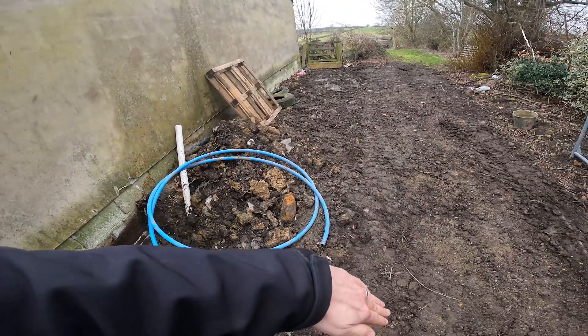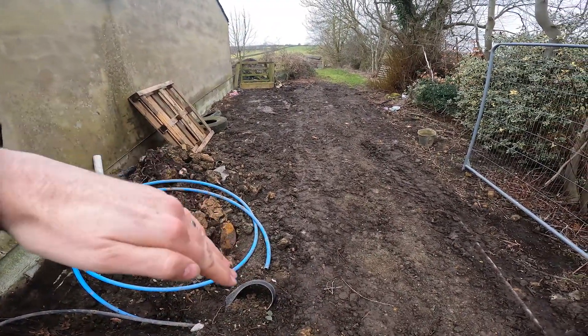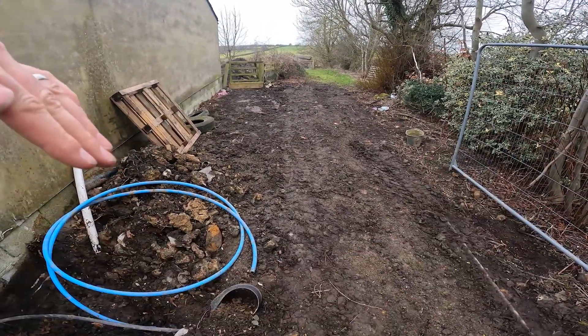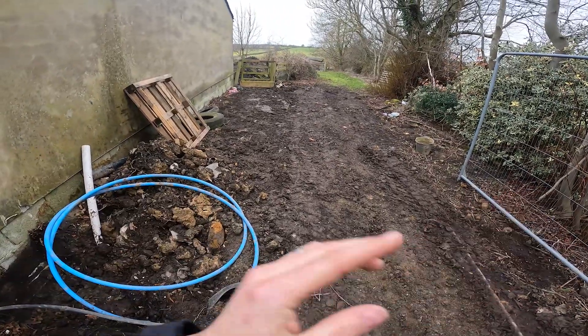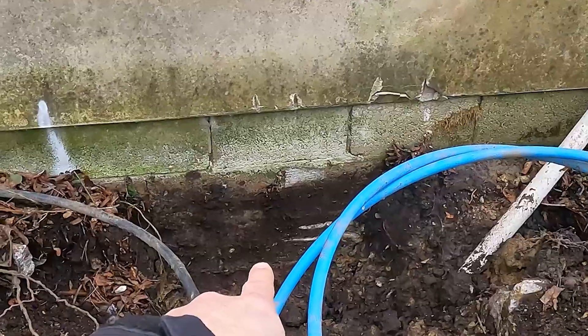You don't want to be at the bottom of your trench, because as you dig your angle down into your trench, if you're at the bottom going 45 degrees, there won't be enough to bend up. If you just land at the bottom of your trench, there's no angle to bend up and it's really hard to get in — you'd have to dig deeper.